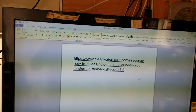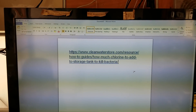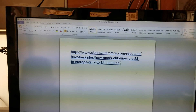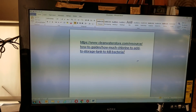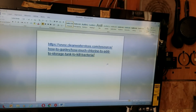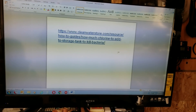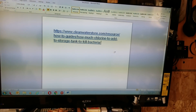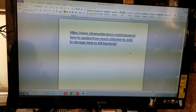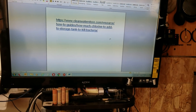You can check your water down the line and make sure you keep it chlorinated if you go long periods of time. Chlorine will burn off in the sun, but in an enclosed tank it won't. That's why I put a bilge pump on a 50-watt solar panel at my tank, submerged down in the water. It runs whenever the sun is out and circulates the water. It was a 500-gallon-per-hour pump, so in two hours it had completely recirculated all the water in the tank.